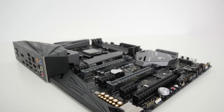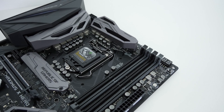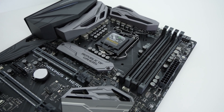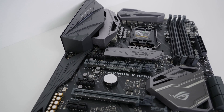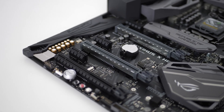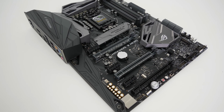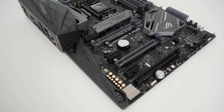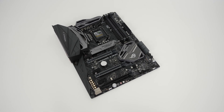Like the Hero 9 board, it has four RAM DIMM slots supporting dual-channel memory and XMP. The board features two x16-length Gen 3 PCIe slots with metal armor to prevent GPU sag. With one graphics card installed you get full x16 bandwidth; with two you get x8 across each in SLI or CrossFire. This reduced bandwidth isn't a major issue for current-gen GPUs. If you want x16 across both cards, X299 or Threadripper is where you'll need to look.